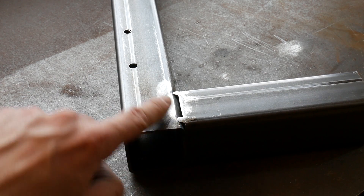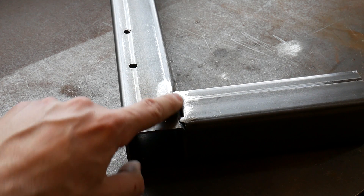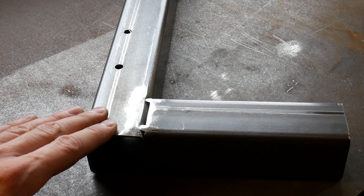I've just done a couple of little tack welds and then ground the surface back so it's smooth, so this will sit flat and there's not a lump, and then I can weld all the other sides and everything will remain flat and square.